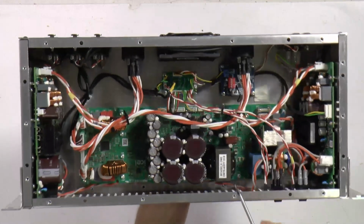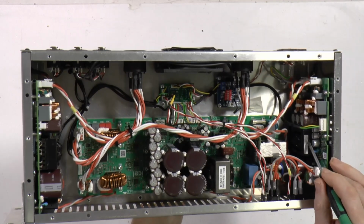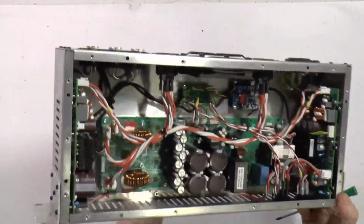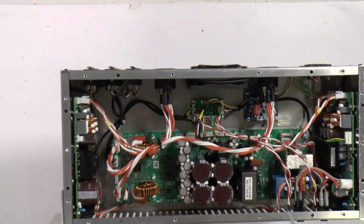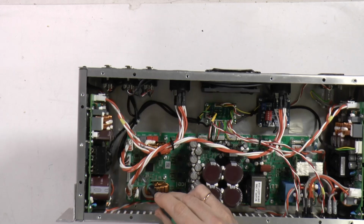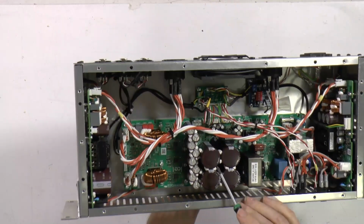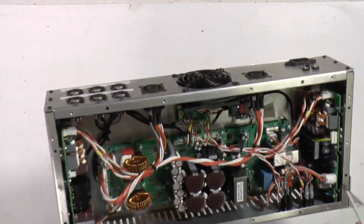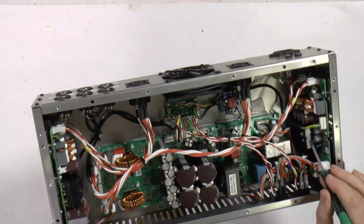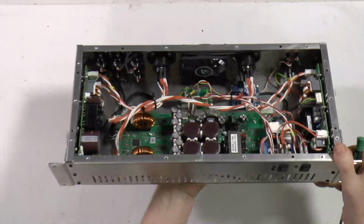This transformer is a high noise source. So here's a nice high noise source, here's a high noise source, and here is a high noise source. Also, when I designed it, I tried to put the high noise sources away from the input. Here is the input for the low frequency board, for the ICEpower 1200 AS2 board. And here, which part is noise resilient, this transformer is close to those input circuits, which are 220 volt circuits, and those are noise resilient.